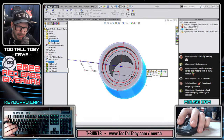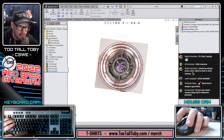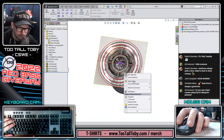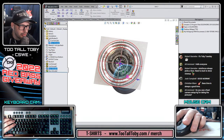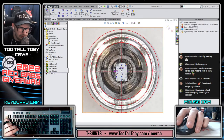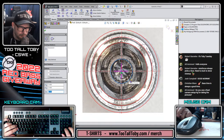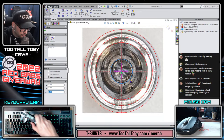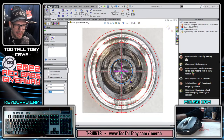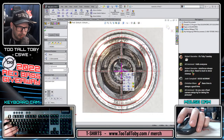So that gives me my common height for that plastic sleeve, and then I can once again show that image, select this lower face, and begin a sketch, and then we can get normal to and create some of that remaining geometry. So basically a rinse and repeat here, 0.222. Let's see how that measures relative to the potentiometer. Potentiometer is at 0.235, so that kind of does give me that compression. Maybe I'll just go 0.23, just to get me a little bit closer.